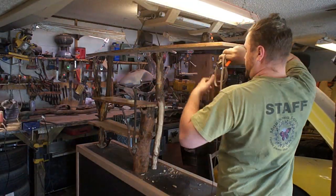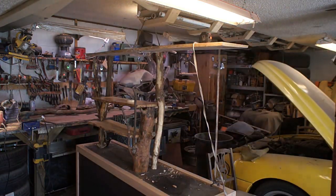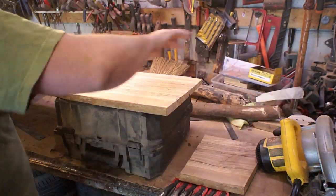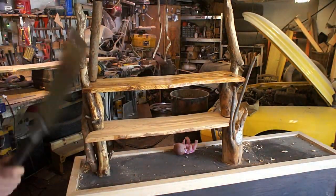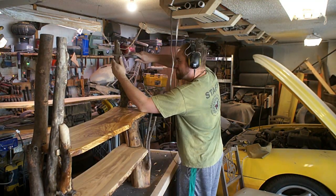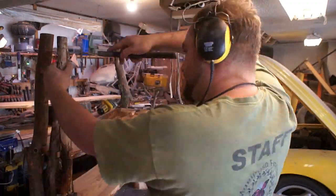Now that I knew exactly where the board was going to sit, I could trim it down to its final size. I put a weight onto the end of the rope so it wouldn't go over the edges of the base, and went back through cutting off the excess. Using a similar method to the other upright, I'm going along the marks I made — sawing along the bottom and making two more cuts above that, then coming back with a chisel to easily knock out the part of the wood that needs to be removed.